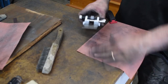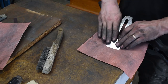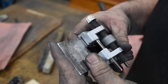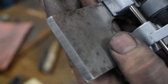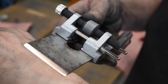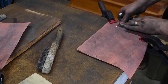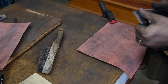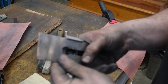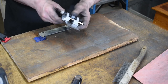I spent a good half hour pushing hard and really grinding away. It's definitely a lot better than it was — right up to the edge, no more chips in it. It's got the proper bevel, it's flat and straight. I went back to the back of the iron on the 120-grit and made it as flat as I could. There's just one little hollow spot but that's not going to affect it. I verified we still have right on 25 degrees, so we're doing good.